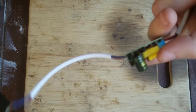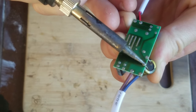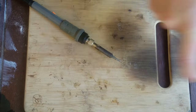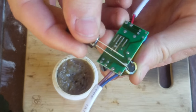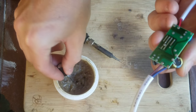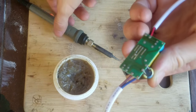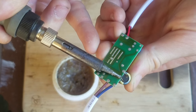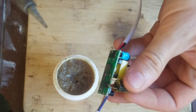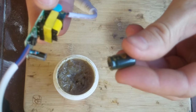I'm going to go ahead and get my soldering iron. You can try to heat it up, but it's going to be pretty difficult. What I like to do is take that flux — I usually use a toothpick. Basically like grease, so you're just going to grease it on. And when you come in with the soldering iron, just kind of pull on the capacitor and then it'll pop out. I'm doing the same on the other side. And there you go — the capacitor is off.